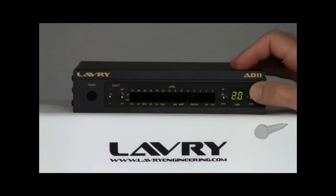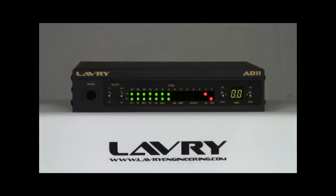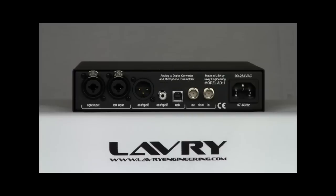An additional safety feature is an interlock with the phantom power circuit, so phantom power is never applied to the input connectors unless the AD11 is in microphone mode. Both the mic mode and the phantom power are selectable on a per-channel basis, so you could record a vocal using a condenser mic on one channel and the output of a -10 guitar effects box or synth on the other channel. Let's take a look at the rear panel.